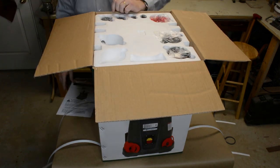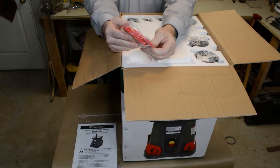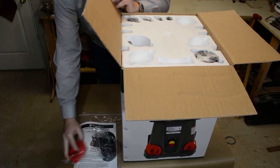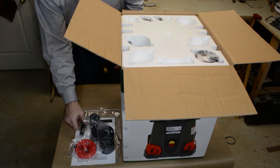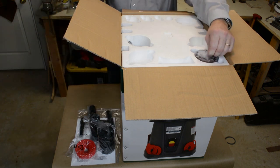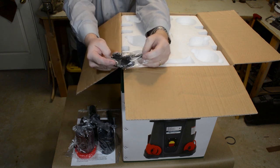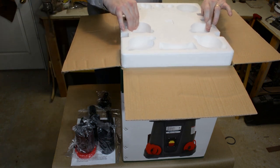The instructions come on top. There's not a lot to the instructions because there's really not a lot to the assembly. The accessories include different plates that go on top of the sander to accommodate the size of the spindle, and a series of hard rubber spindles that go on top of the shaft that the sandpaper wraps around. There are five hard rubber spindle inserts. It gets a little confusing because there are six different sizes for the spindle sander but only five rubber inserts — that's because the sixth, smallest diameter sandpaper tube fits right over the top of the half-inch shaft and doesn't require the rubber insert.